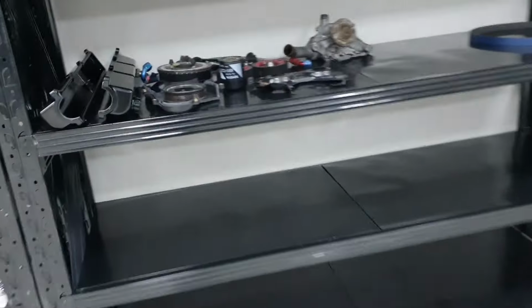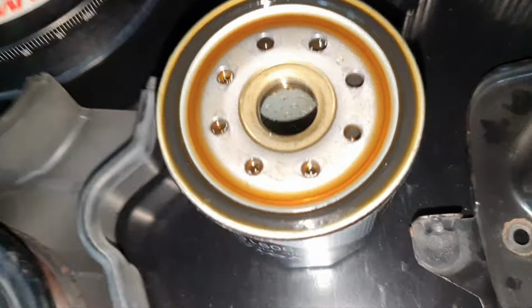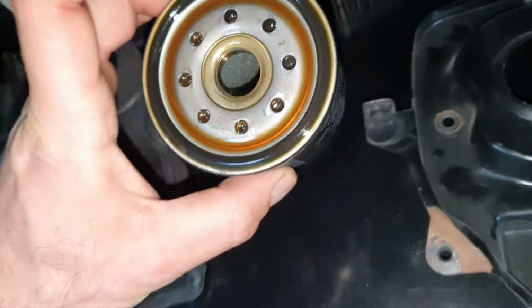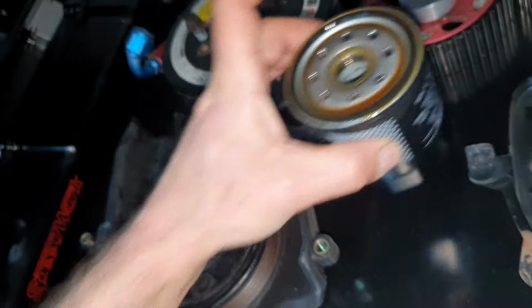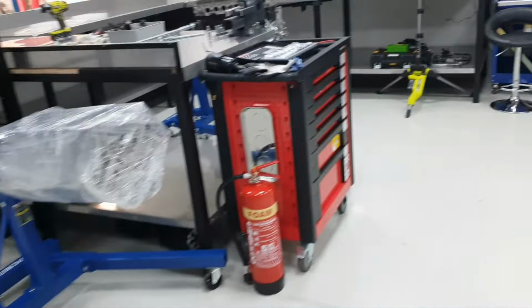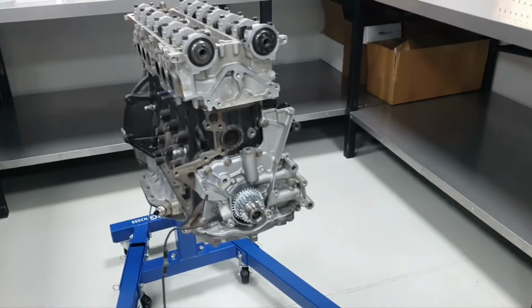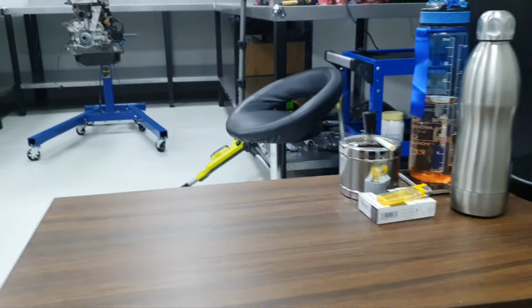And here, I remember something. I remember that I don't have the tool to cut the oil filter. The good thing is that you don't see glitter, you don't see any shining pieces. That's a good one, I guess. Right? Yeah, I need to also order the tool to cut the metallic filters. Now most filters are carton and not like that. It's a good tool to have, right? Let's move on. 3 minutes break.